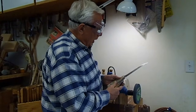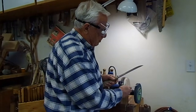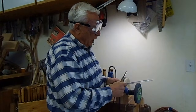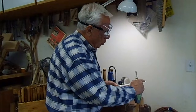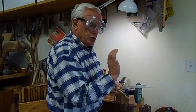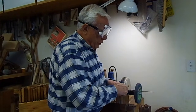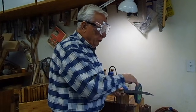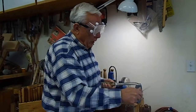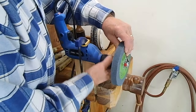What I'm watching for on the grinding wheel is raising the burr. Once the burr is raised, that is as sharp as the wheel will get it, so you do not need to grind anymore after that or you're just wasting material. I watch to make sure I have the burr along the whole surface all the way out. On the back side of a knife, that burr is a hook over the edge. I push that burr this way, then flip it back the other way, fatiguing that burr until it falls off. I could do the same thing on the buffing wheel but it would take much longer. Now we will change to the buffing wheel.